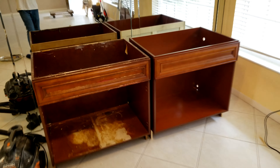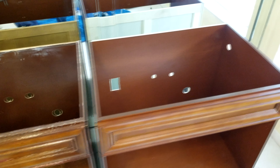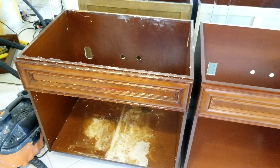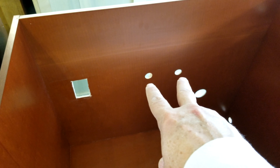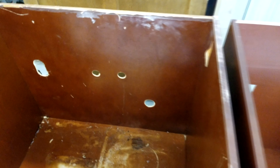Here are our two cabinets and now all of the holes are finished. You can see how we just duplicated what holes were on the old one, transferred the measurements over to the new one, and now we're ready to install it under the cabinet — sliding it right back underneath the granite gingerly. Keep in mind we have maybe an eighth of an inch space between the top of this and the granite. Look at the mess they made with their holes, especially that one. Then you look at this — it's much cleaner and more professional. We made the holes for the hot and cold water pipes smaller, which is what they should be for a half-inch copper pipe. Whereas over here they made it one-and-a-half-inch holes, which is typically done by guys who aren't very accurate with their measurements — they make the holes big to give themselves more margin for error. But if you're careful with your measuring, you don't need margin for error because there is no error.